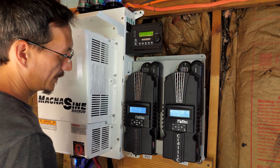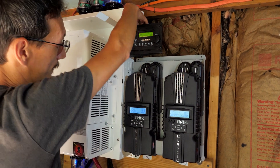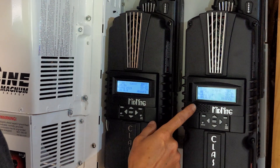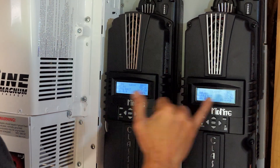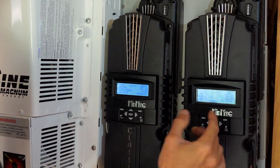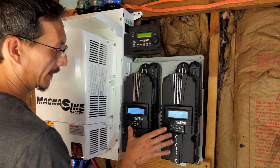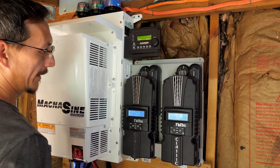Like I said, by 9:30 a.m. our batteries are topped off. Now I'm going to power up array number two. Let it settle. Now these just went immediately into absorb — our batteries are at 55.4, 55.3 — that's exactly where our float point is set. We have to set these to absorb for three minutes, which is the minimum you can do with these charge controllers. You don't even need absorb with lithium batteries — you just want to bulk it and then go to float if you can. So these are going to take three minutes and then they're going to float. Batteries will be 100%.